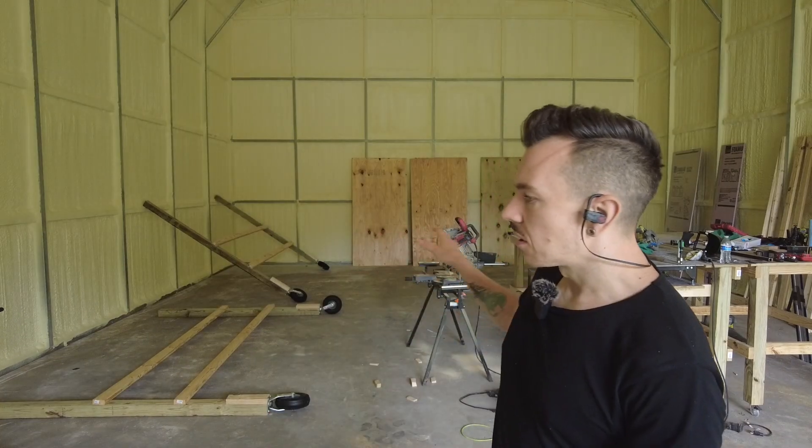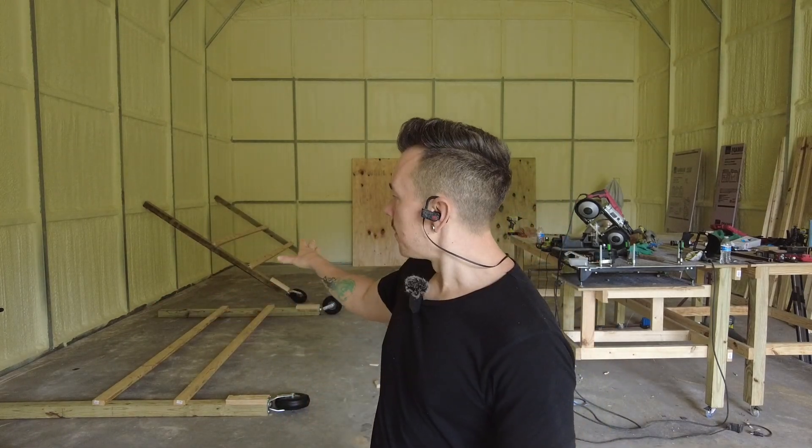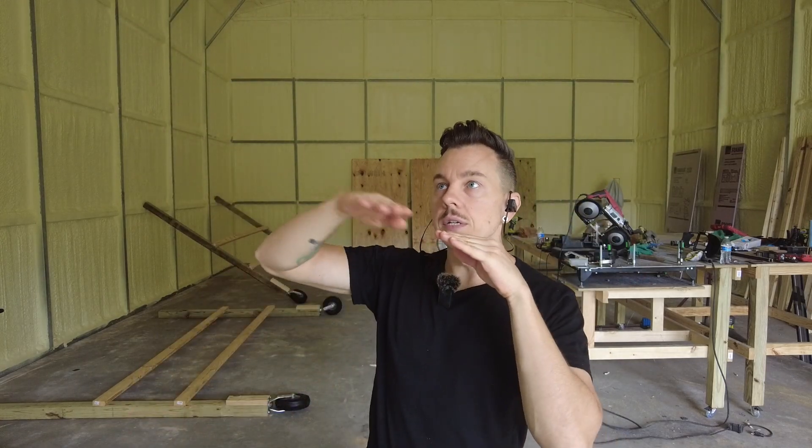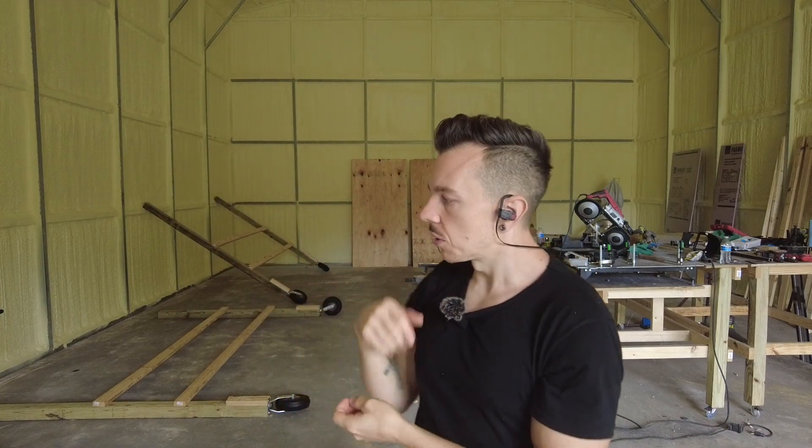Here I am in my garage — a couple lambos are missing at the moment — but I've got my saw and a couple tools moved over from the other shop I was using before to build out the box truck. We're gonna build a chicken coop today. Behind me are two sets of four-by-fours, pressure treated so they can get all wet. One side is seven feet tall and the other side is eight feet tall. The idea is a single slanted roof, so you don't have to deal with caps and stuff to fill creases on top.